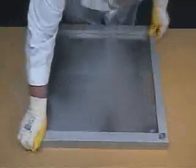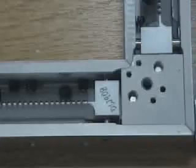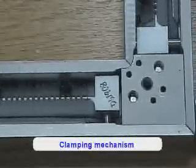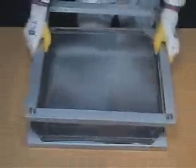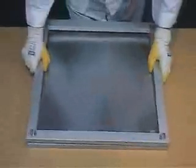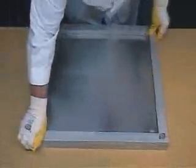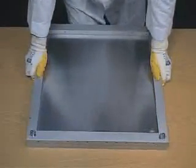Position the frame over the loading jig. Apply air pressure to the frame by operating the foot valve, keeping the foot valve depressed. The clamping mechanism will now operate. Offer the frame onto the loading jig and apply firm pressure and lateral movement to engage the teeth. On successful location of the mask in the frame, release the foot valve.